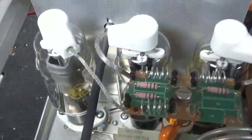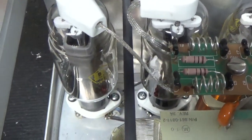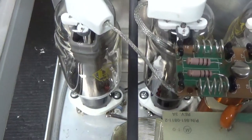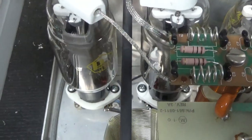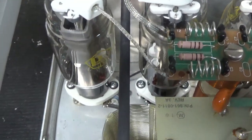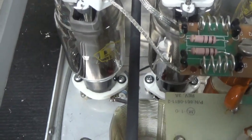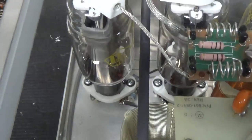Just remember when you go to plug your tubes in: always make sure you're going straight down — don't go at an angle, and don't rip them out at an angle, or you can end up damaging the clips for the socket. Also make sure the two large pins are going in the two large holes, because if you press down you can get the large pins to go through the wrong holes and possibly damage things.